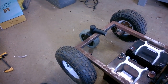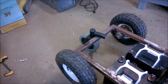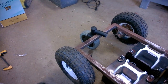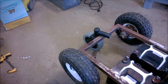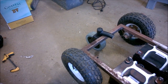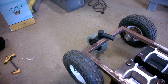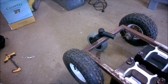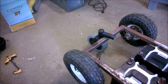So 1 tire in the back, not really going to cut it. My target payload is like 60 pounds. So we're going to have like 60 pounds over that rear tire. And for a crawl space robot, we're going to be going over dirt and stuff. And there's no guarantee how firm that dirt is. So 60 pounds on that little tire on unknown soil compaction, too shady. I'd want it double that. Which puts us into the ballpark of 1 caster per side, which will work.